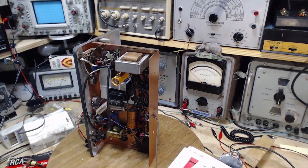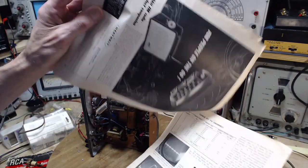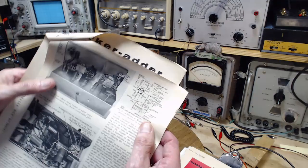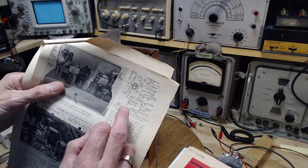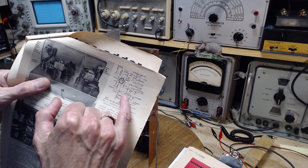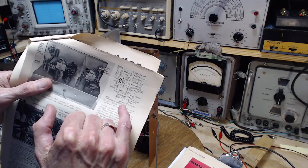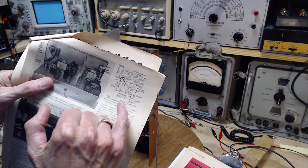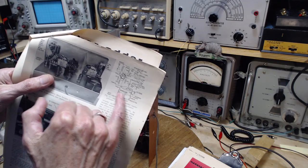Oh my my, now there are some other changes in here that are specified on a diagram. Here it is. So in this diagram is the removal diagram. They're showing what to remove. So the dotted lines get removed. So you see there's a dotted line with a 100 picofarad removed. And down here, this little piece here, removed. And so this is, I think, where they're fetching the output. I don't know for sure. I'd have to study this more.